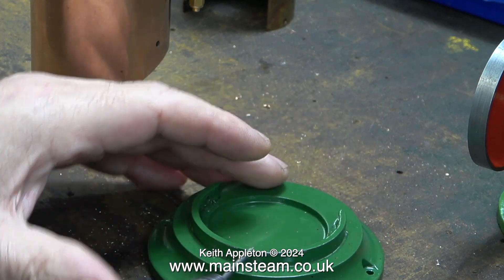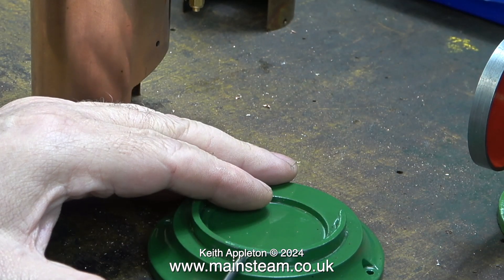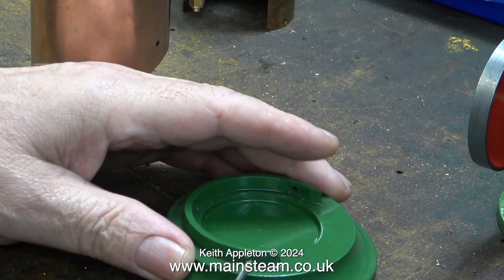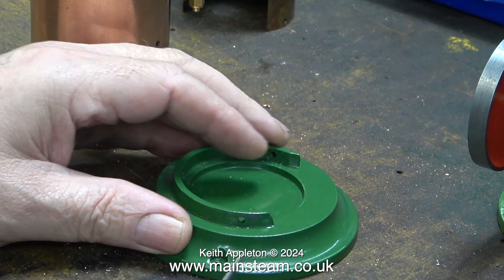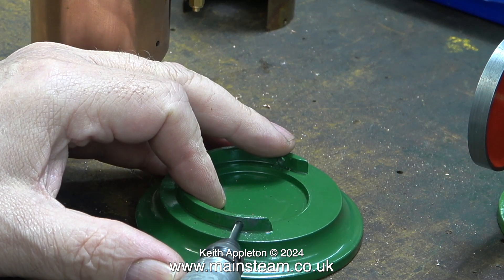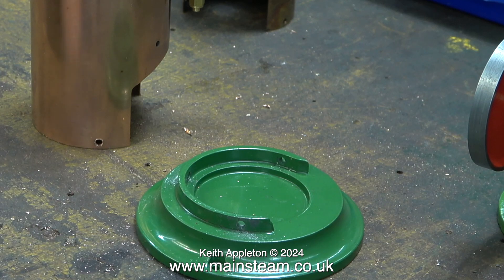On the original Vulcan, the boiler was actually bolted through with nuts and bolts — three of them — from the base to the barrel. I intend to thread the base 4BA, and once I've done this, I will enlarge the holes in the barrel to clearance size, which is 9/64ths for 4BA bolts.